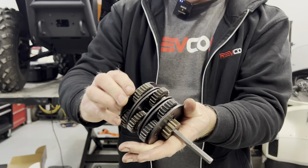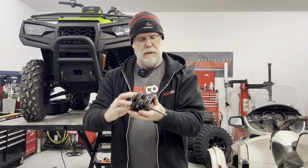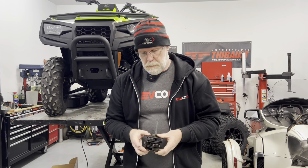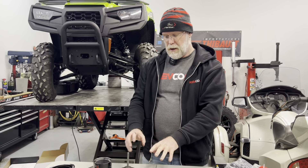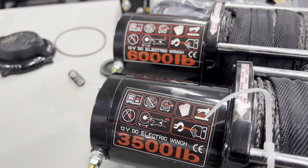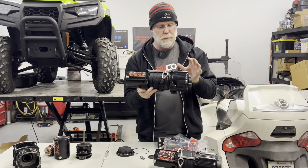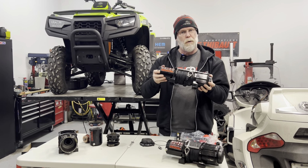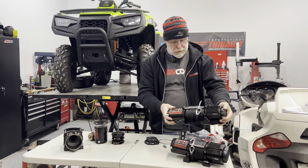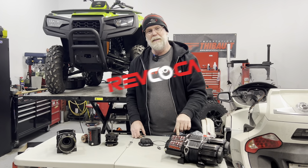There are many brands and most are pretty good — like the Stealth from KFI, the Stealth series, which I love. Same type of build, but what's cool about these Octane winches is that they're much cheaper, and I was involved in the selection process. These are available in 3500 pounds and this is the 6000 pound model. You can see it's pretty much the same except the spool is bigger and the planetary transmission is different — same motor but driving a different planetary gear set. This is why it's an extremely compact winch. This one is $299 and this one is $399, and you can get these at revco.ca.